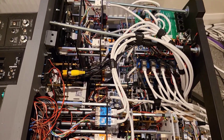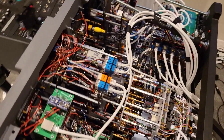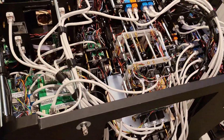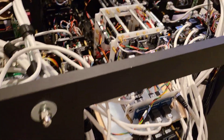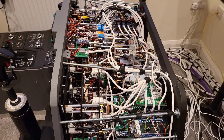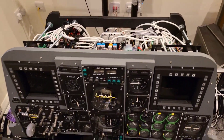From a maintenance point of view, I've designed the glare shield's side profiles to be easily removable, and after disconnecting just a few wires at the back of the glare shield, that whole section lifts off quite easily as well. The rears of most panels are straightforward to access. It's only those few panels that run along the bottom of the front dash, embedded amongst everything else, that would require just a little more effort to access.